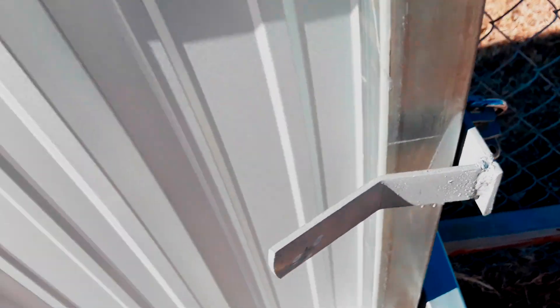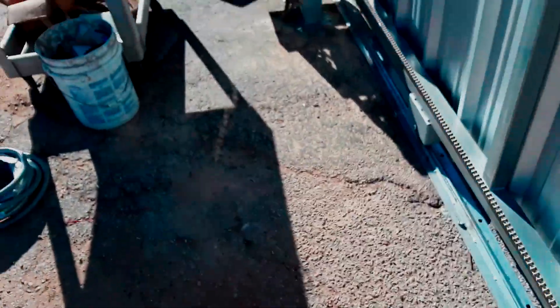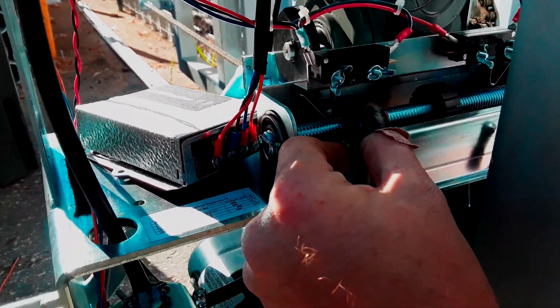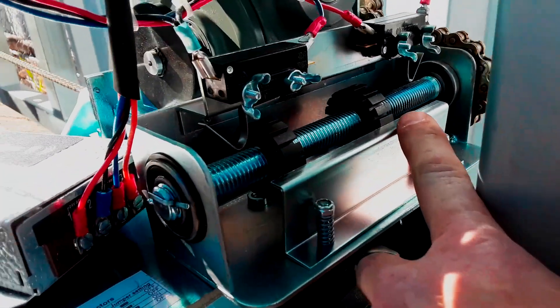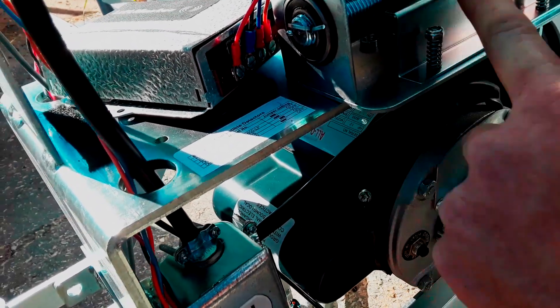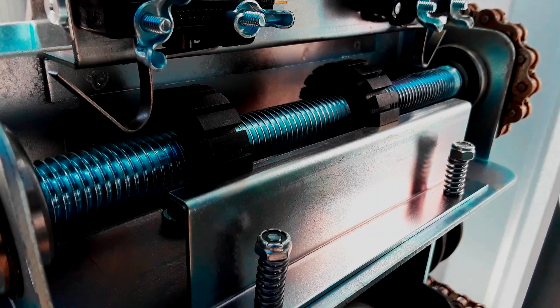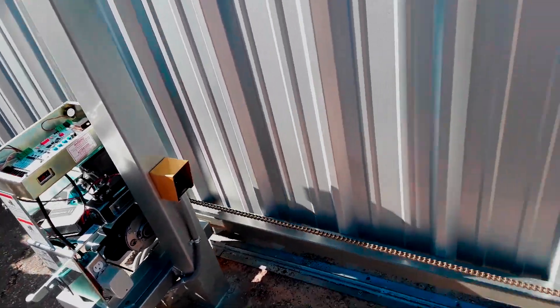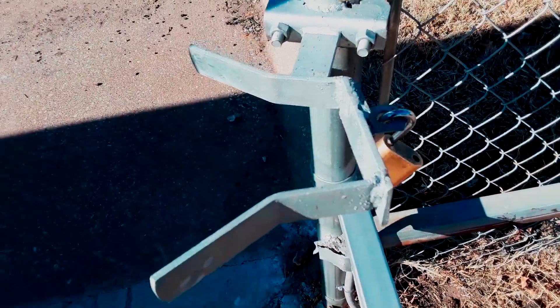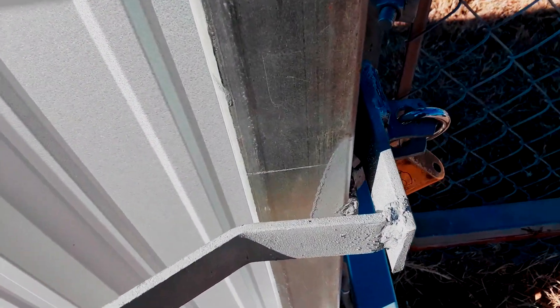All right, that's pretty good. I'm going to back it off to where it doesn't close as far. You do that by releasing this plate, and in this case we're going to spin it towards the switch — just one notch. It's not uncommon for the limit nut that you're not adjusting to get out of position, so you just push it back over to where it slides in the slot, and then both of them should seat just like that. Now we'll turn it back on and give it a command — it should open up. Because we have the gate set to open, stop, close, I'll give it another command. The gate will stop, and then I'll give it a close command. We should get about a half inch to three-quarters of an inch backed off.